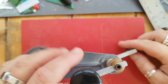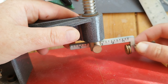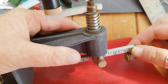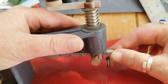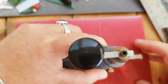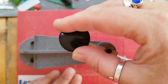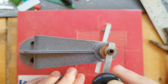Taking this — if you've never actually used one before — you've got adjustable parts on it. This is to adjust the actual wheel, so you've got quite a few little cutting wheels in here, there's three. What you're doing is adjusting that so you can alternate between the three as they get used, and then you've got this adjustable piece here which you use to slide backwards and forwards depending on if you want a tiny circle or a larger circle.